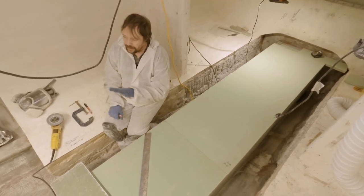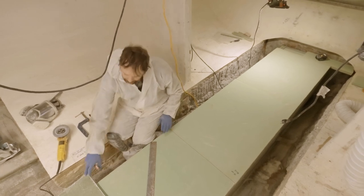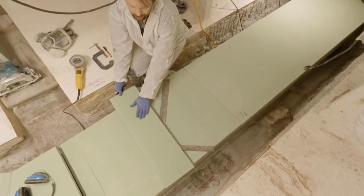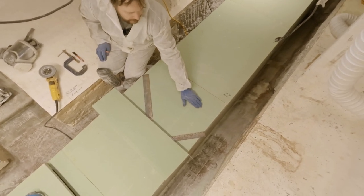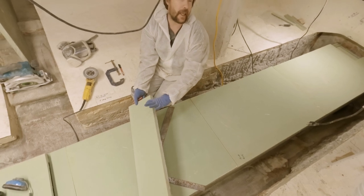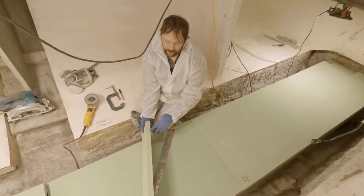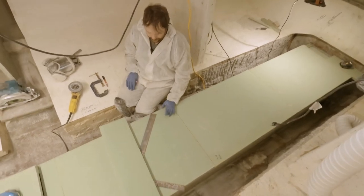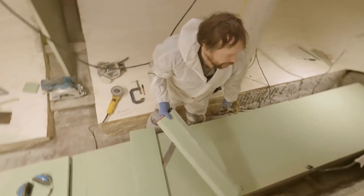Right now we're just in the stage of getting this first layer cut. These are already laminated on the other side just like this one, so it'll be laminated side down, then we'll glass over this, wrap it, and then put another layer on and laminate that over the top. So we'll have two inches of foam which gives us about R-10 value, give or take. Close to three-quarters inch of laminate total - each layer is a little shy of a quarter inch, and we'll have three layers. When you laminate two of these together it's very rigid, but not rigid enough for us and we're not taking any chances.